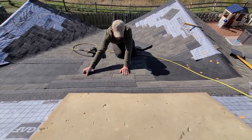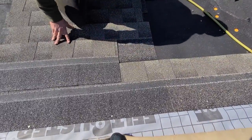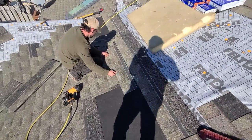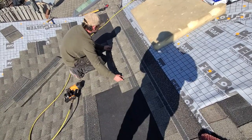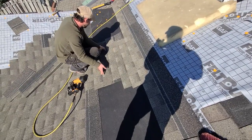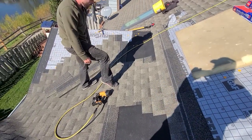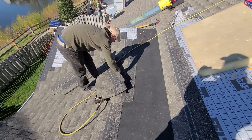Look at this — we ran this much short. Rather than doing it like this, laying this all the way up there and going 'oh no this is going to look like crap,' what I can do is snap a bunch. Rather than going 'let's just drop that one down a little and that one down a little,' rather than having two big cheat rows, I'd rather cheat this one, this one, this one, and that one. Maybe even this one. So I'll put one more row on a cross — that looks good. And then I'm going to cheat them all just a few — about two centimeters each.